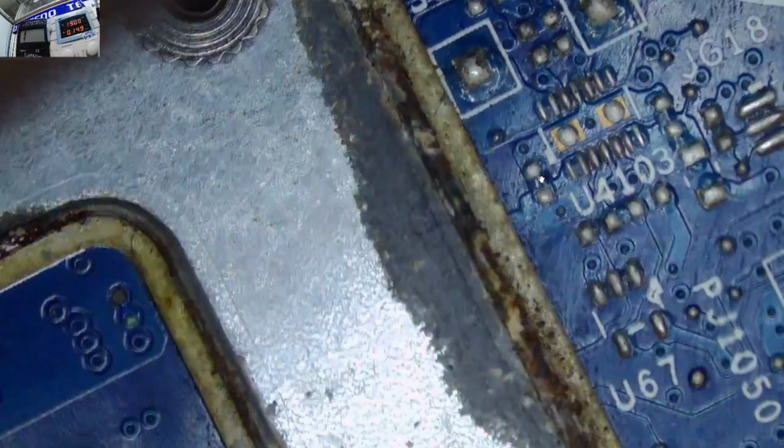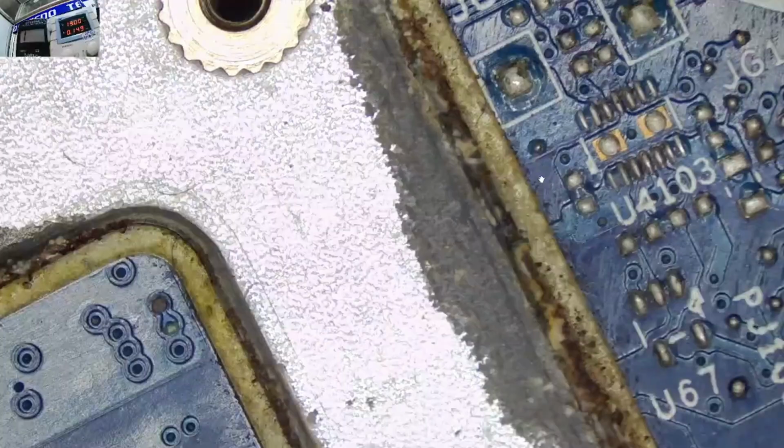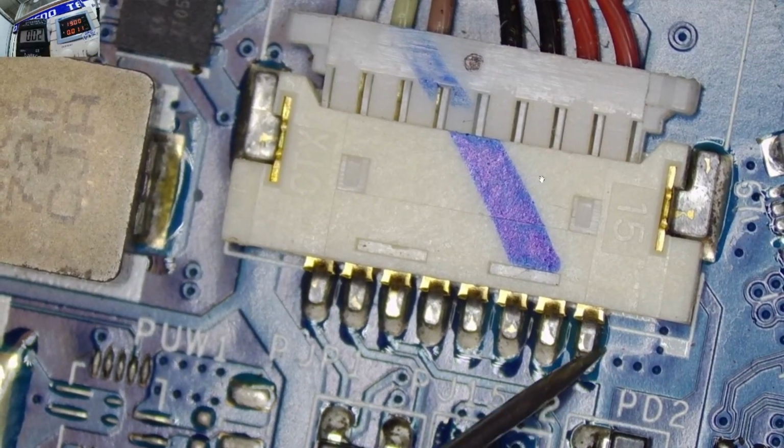Yeah, the fact that we are having a light on the charging port is a clear indication that we are having our 3.3 volts. Now let's try to remember on this laptop, the BIOS chip takes 1.8 voltage. It's not like in others where we have 3 volts. So you should not go on the BIOS chip and you get 1.8 and then you start thinking, hey, I'm not having enough voltage on the BIOS chip. On this laptop, the BIOS chip takes like 1.8 volts.